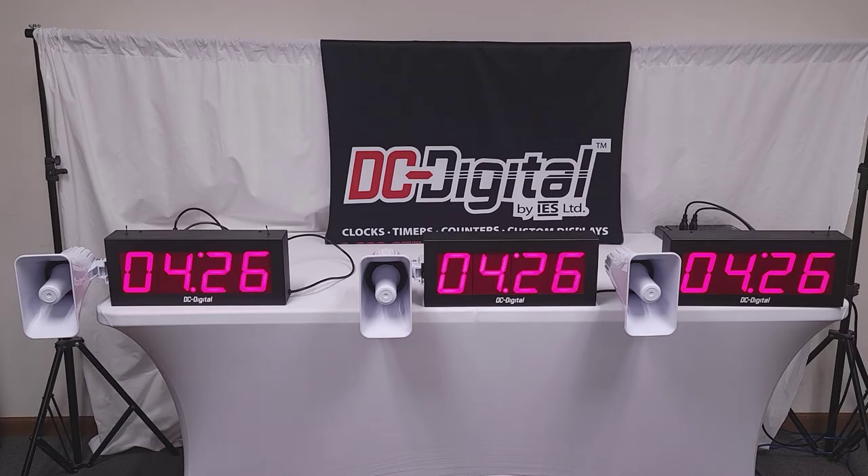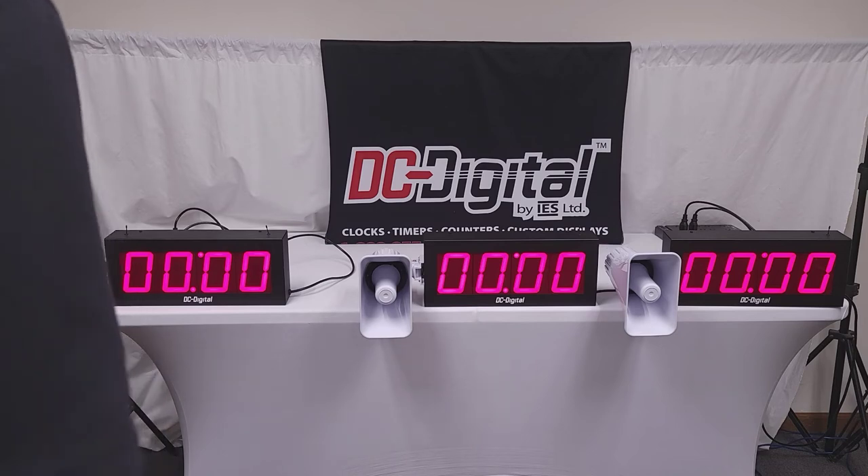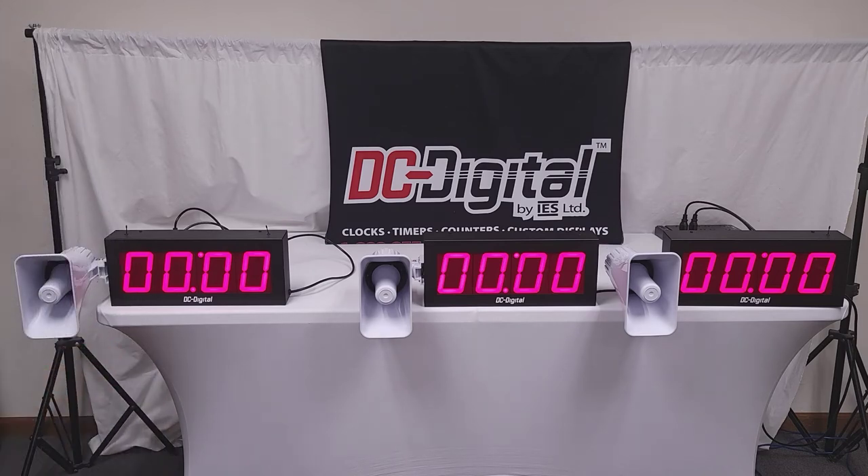We have a different tone at zero — you heard that siren tone. So I'm going to stop it, zero it out, and set ten seconds on here. We'll put ten seconds on and I'll step out of the room so you can hear the different tone — that one was kind of like a siren. Just to demonstrate the power: I think they're 122 dB at one meter. They're 12-volt horns, a dual-tone horn. I think they draw one amp, so if you wanted to buy those separately that's possible too. We have relays activating the two different tones.